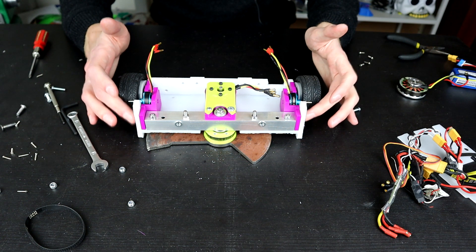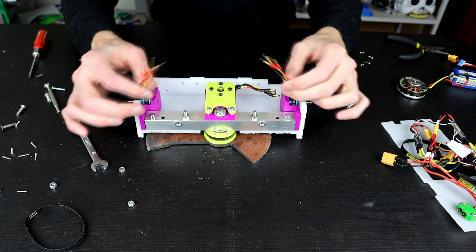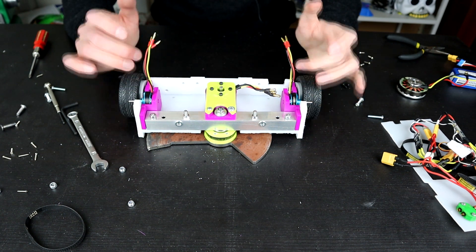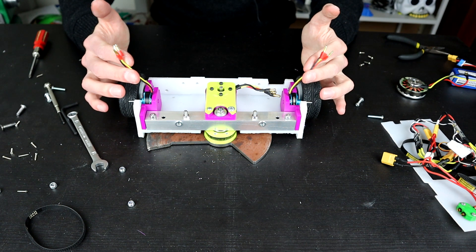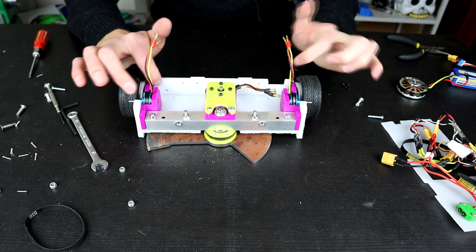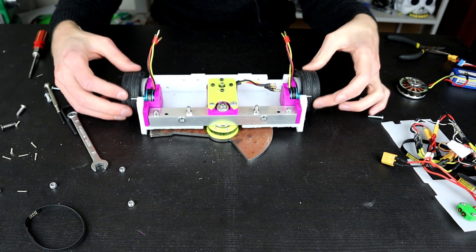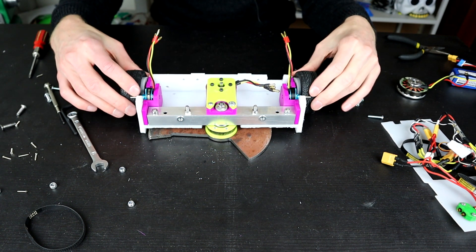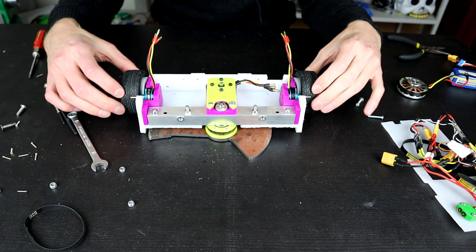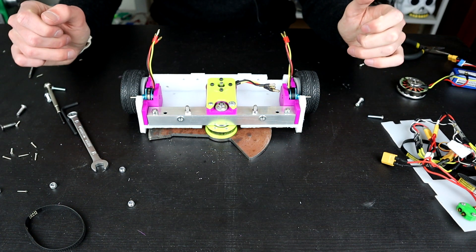I'm going to see if we can get a quick test drive going. I'm going to use Boris's setup because I haven't had time to repair the wiring. As long as everything works this has been a good prototype to advance on in the future - doing the CNC panels, changing the motors over so the wiring goes into the robot rather than up out the top, which would help quite a lot. Maybe also upgrading these wheels because they do seem a touch flexible under force - the bearings don't hold quite as well inside the flexible material as they probably should.